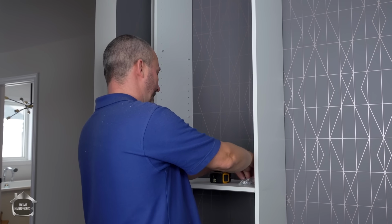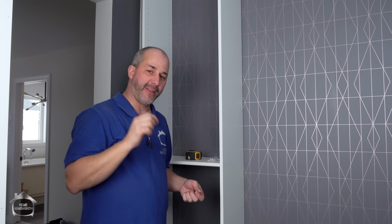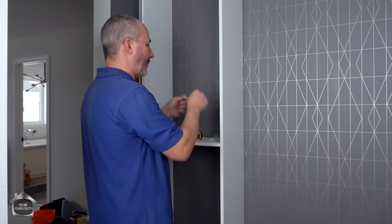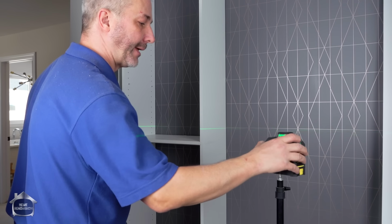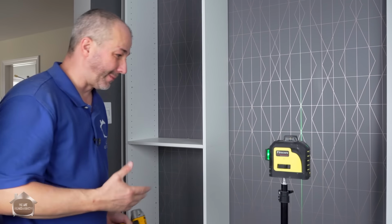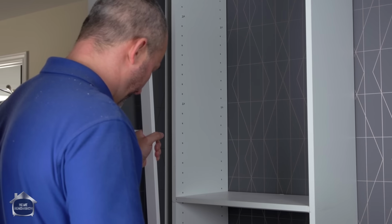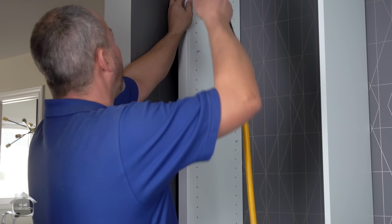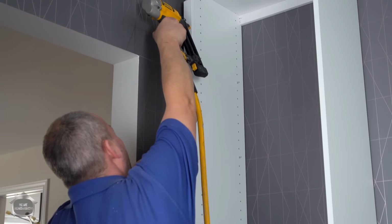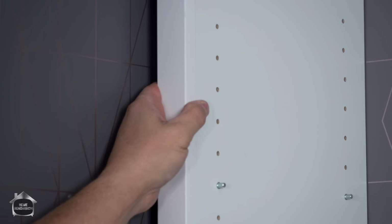Anyway, here we go. And when you go to cut your shelves, remember your spaces, you wanna take a healthy 1/8 of an inch off of that, just so that there's room to drop them all in place and they're not gonna be sitting there fighting with you. So what I did here is I just took my laser and I just checked the wall itself to make sure it was relatively level. Plumb, sorry, for everybody out there who doesn't like my slang. What I'm gonna do, because I don't need to follow the contour and scribe, I'm simply gonna install this trim board on the shelves. Well, like maybe a 1/16 or a 32nd of an inch overlap, just to get rid of this line. If I go perfectly flush, it's ugly. As soon as I go bam, it's actually pretty.